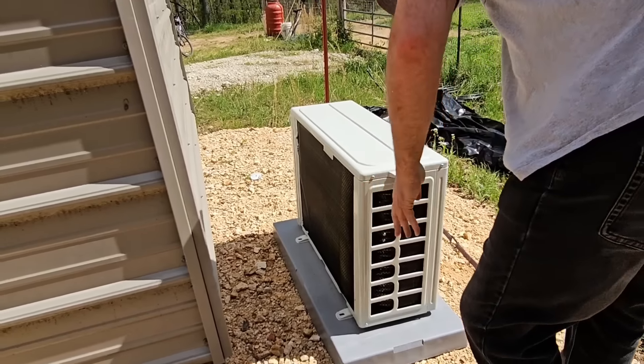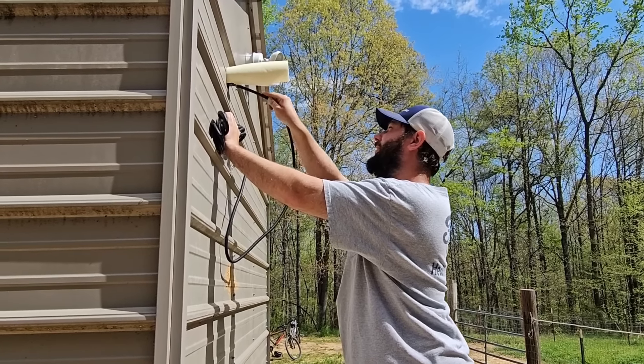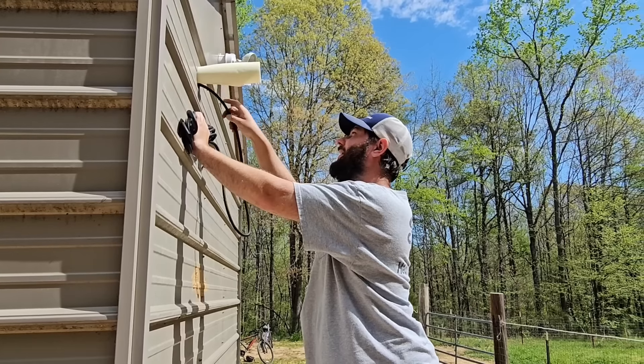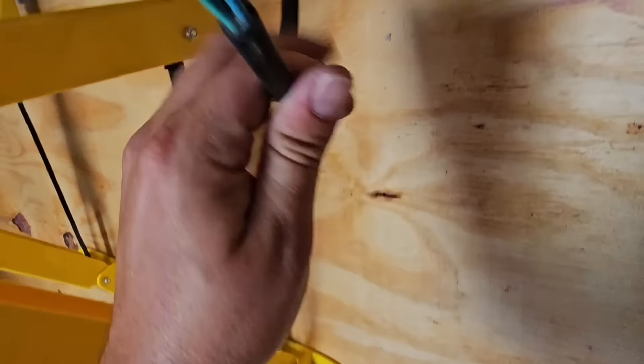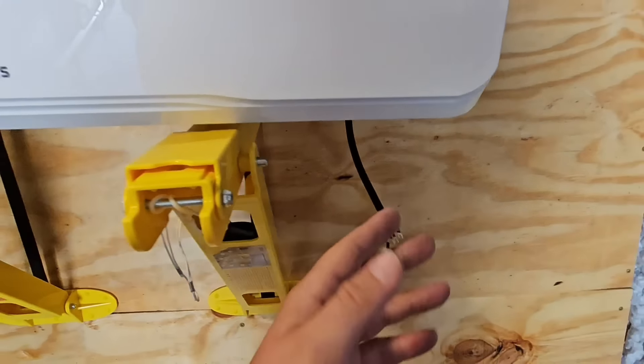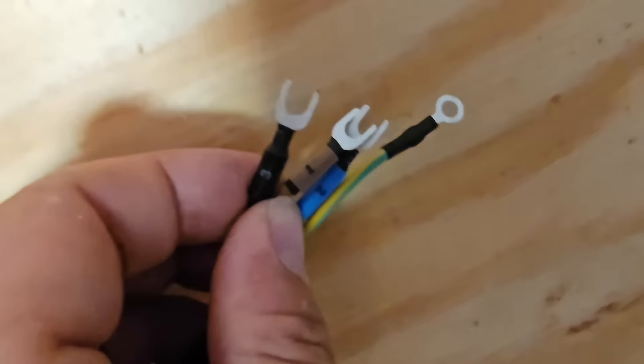I've got a place for the outdoor unit. I'm not going to mount it on the side of the building because of the way the ribbed metal runs — I'm going to mount it on a pad on the ground. Make sure you have a dolly because carrying the unit isn't the best option for your back. I'm going to measure from the building to the coil, since the coil faces the building and the fan faces away. I like to have at least 12 inches between the unit and the building. Check out this 22 SEER rating — pretty awesome.